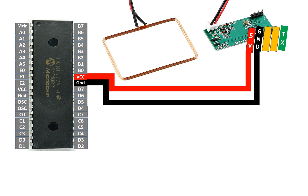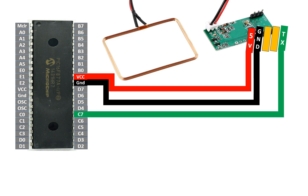The TX pin of your module will go to the RX pin of your PIC16F877A. The RX pin of the PIC16F877A is pin number 26, which is port C pin C7. In this way our connections are completed. The rest is just programming — I will show you how to extract the data from this module using basic commands, and the rest of the processing you can figure out yourself for your application.